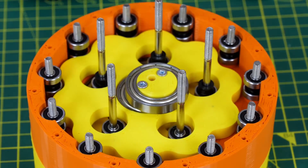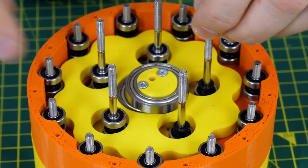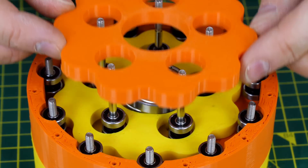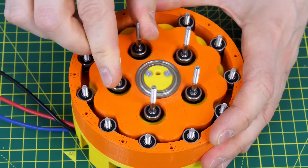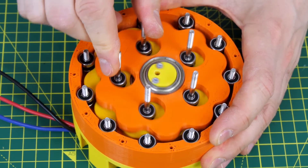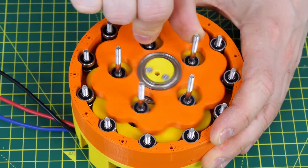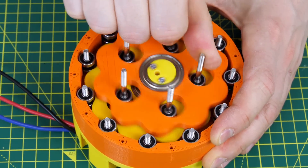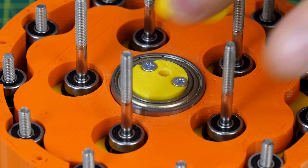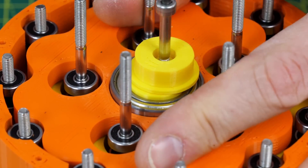It's time for another set of bearings and another set of spacers for the output shaft, and then we can add the second cycloidal disc. Now we should be able to see both discs running, but they're running 180 degrees out of phase with each other. The cam is also offset by 180 degrees, so all together it should run on center, minimizing vibrations.